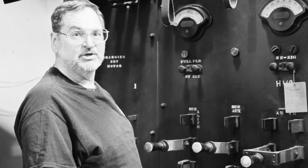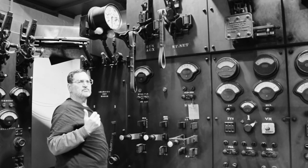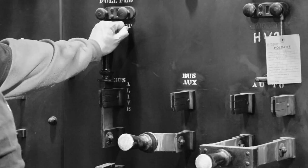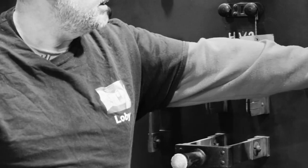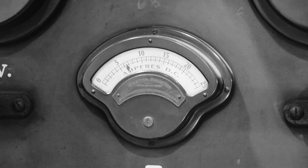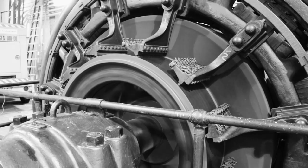You have to remember the machine is going on 118 years old. Here's the circuit breaker that takes 600 volts from the third rail and makes all the switches alive. Now one by one I'm going to slam the bus alive switch in, cut in the bus auxiliary, and now the field is alive on the old rotary converter, and it's slowly coming up to its 10 ampere set. As soon as it hits full field, I'm going to close the main armature switch, which starts the rotary spinning.